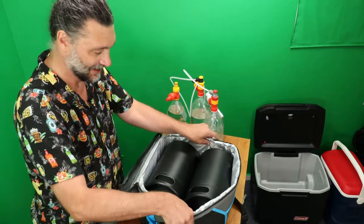A little bit slow. Yeah, it's a little bit too slow for me. Is that all the way open? Yeah. So what are we gonna do? Let's take this off here. I'm gonna go aggressive here. By the way that was pouring, I'm gonna cut that basically in half. So, I would say 4, but it is 3 millimeter. All right, now that we've purged the line, let's see what we get. It's faster. I think it's about right. I think we could even go shorter.